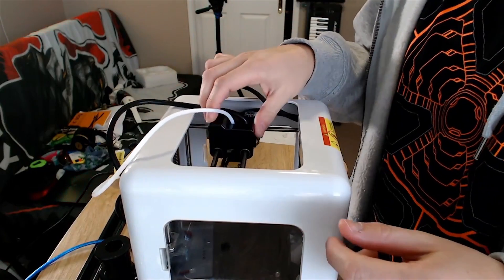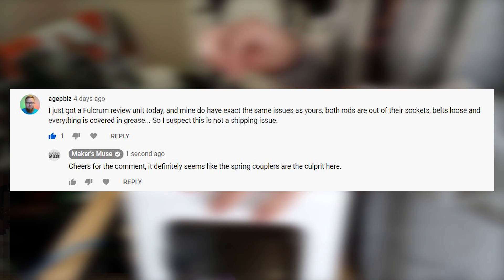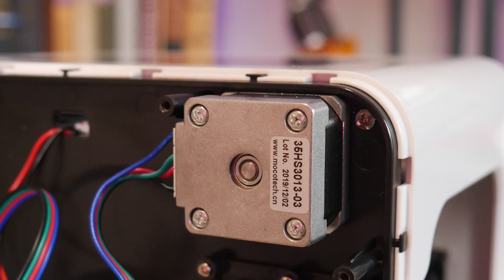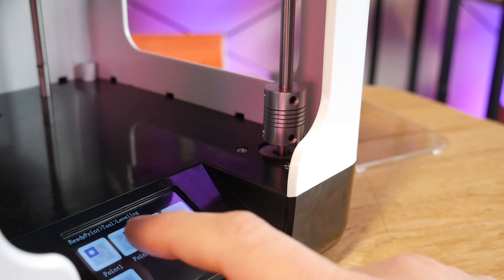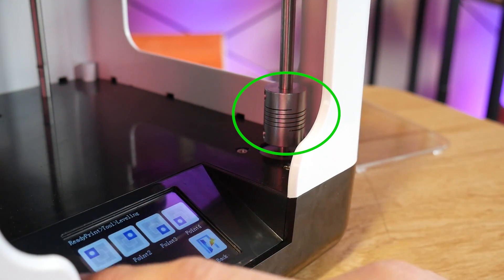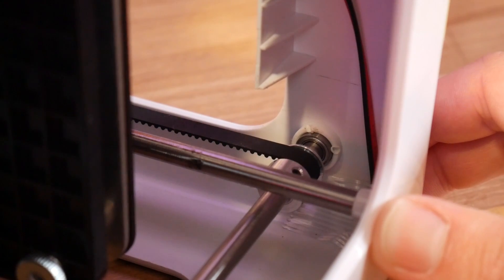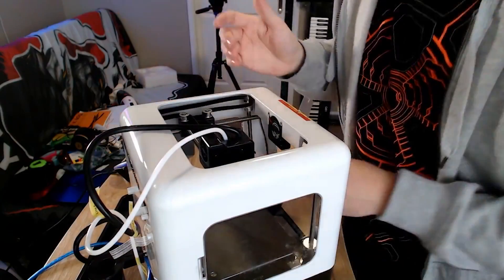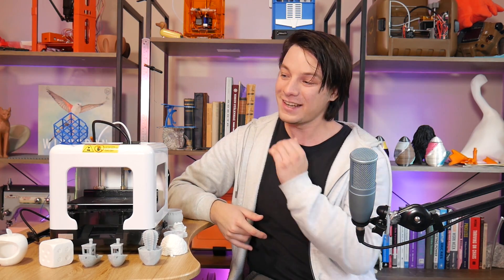This machine arrived broken. I've since received a comment from someone else saying their unit also arrived broken for evaluation. The issue is the HBOT design requires motors at the bottom with a really long shaft, and the timing pulley connects via a spring coupler. I think in shipping, the spring coupler compresses when the machine is jolted, bumping that rod out of its housing and bearing mount. Once it's out, everything falls apart — the belt comes loose. My machine was full of grease from everything flopping around on its way from China to Australia. That's something that definitely needs to be improved from the factory; maybe they should use a different style of coupler, like a star rubber coupler instead of the spring style.